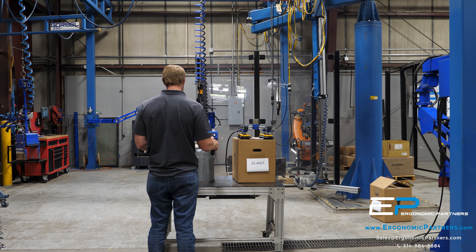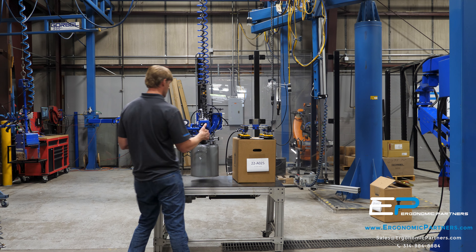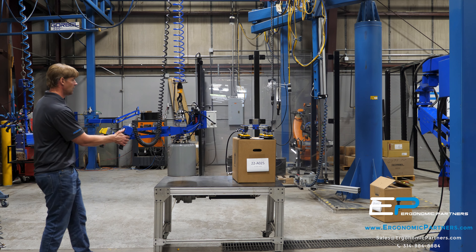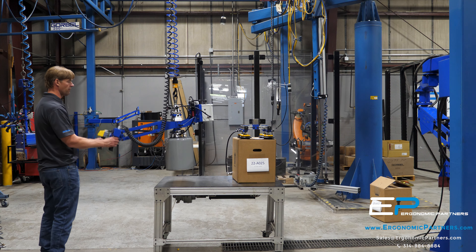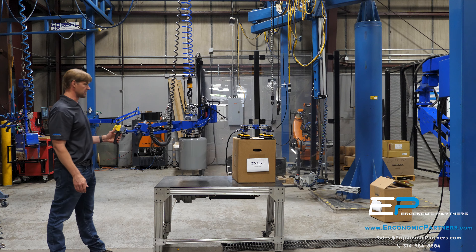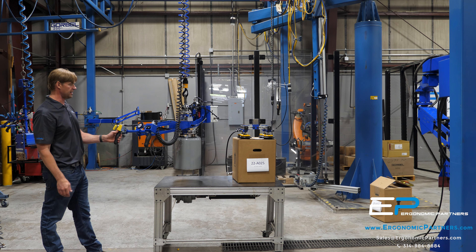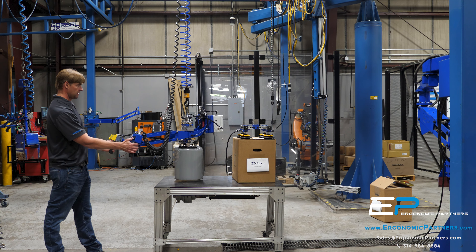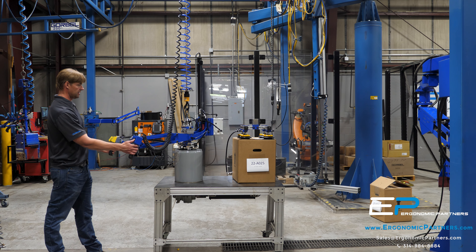We'll come on here on the pail. On the pail you're pulling about 23-24 inches of mercury. You've got a floating handle here as well as an anti-drop circuit to prevent you from releasing the part if you lose air. So I can hit the release button here, but until I actually set this part down I'll hold the release button. As soon as the weight comes off it releases.